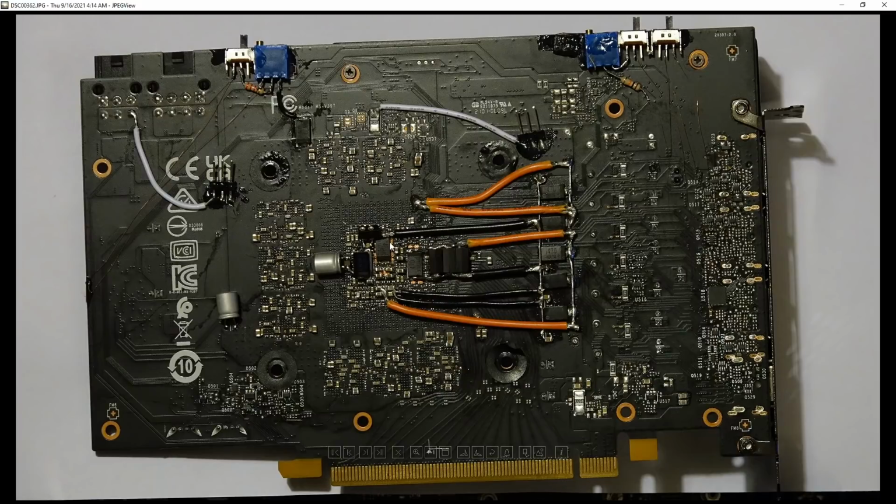Ti on air cooling, or well, water cooling you might see some benefit, but on air cooling the benefits are extremely minimal and the increase in power consumption is kind of ridiculous. So we're not going to start with the core voltage mod. This is really useful for sub-zero overclocking, so like dry ice, liquid nitrogen type cooling. But for ambient, yeah, don't bother. It's really not going to get you anywhere.